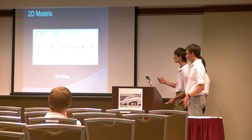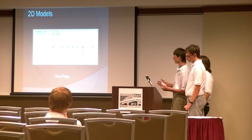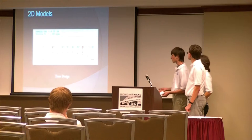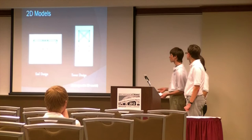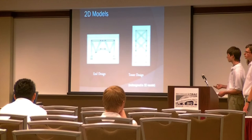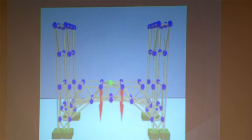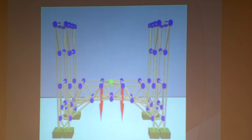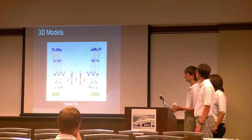Here's a picture of one of our first designs once we put an arch into our truss. The program was really good at helping us find where the best places were to have the arch angled and how to put in triangles. After the deck, we started designing the ends of the deck, which we found also benefited from having an arch as part of the support for the tower. We had an initial tower design with four towers but decided it was better for the weight to just have two towers, with basically the same amount of strength. After putting everything into the 3D program, we had to input every joint and member and make sure it all measured correctly.